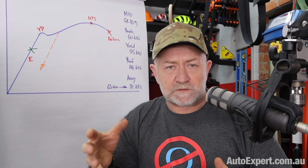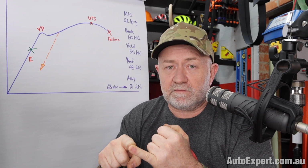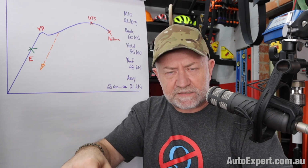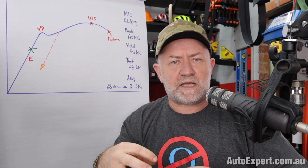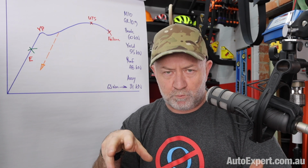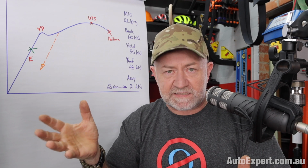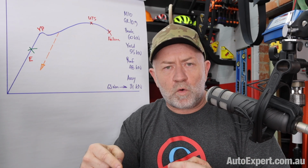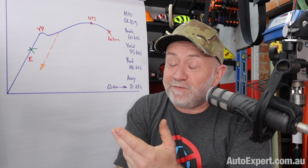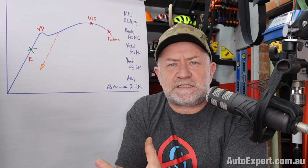And this is important because in things like cylinder heads, there's not a lot of spare real estate. Real estate's at a premium in a cylinder head because you've got to have mechanical clamping locations, and you've got to get air in, and you've got to get exhaust out. You've got to have a fuel injector in there. You've got to have mounting posts for the various components, such as camshafts. That's kind of important. And you've got to have valve guides in there. And you've got to have water and oil as well. There's a lot going on in a cylinder head. I know it looks boring from outside, but actually designing one is like playing three-dimensional chess in the dark.